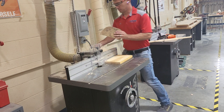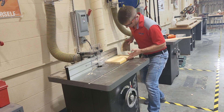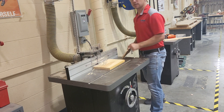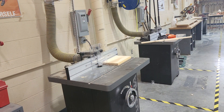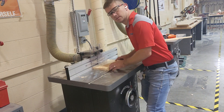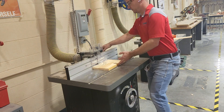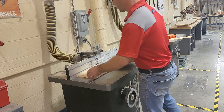I had my push sticks accessible — close by and ready to go. I started without my push sticks and then got to the point where I didn't want my hand to get in there; the blade guard was getting in my way, so I used a push stick. Body position-wise, it's okay to start back here, but you probably need to move out and move across with the board. Don't just leave your body hanging in one spot. If you finish right here, that's fine — you don't have to come all the way into this space.